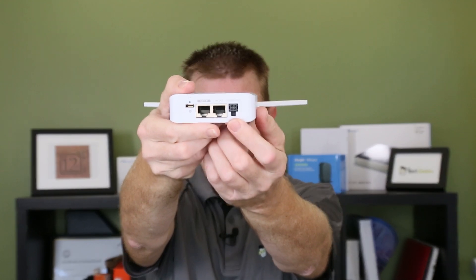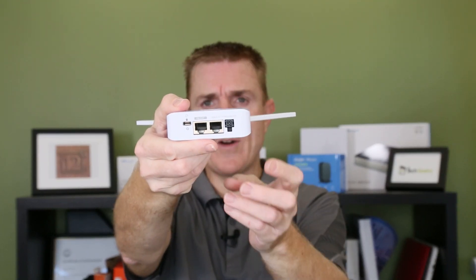So if we are maybe wanting to set up and run out to another access point a little bit further away, the PoE out will give us something fairly useful. This device already does wireless, so this is not only just a 4G router but it also does wireless — that PoE out is maybe going to be used for something else. You could even use that and plug in a 48 volt AirMax product, like the Nano Station 5 AC, the NS5 AC, which does support 48 volts. Then you could run that out to a point-to-point link. There are quite a few options — VoIP phone could also be one. You also have a DC power block option as well, though there are no cables in the box to do that. So two gigabit — two one-gig ports.